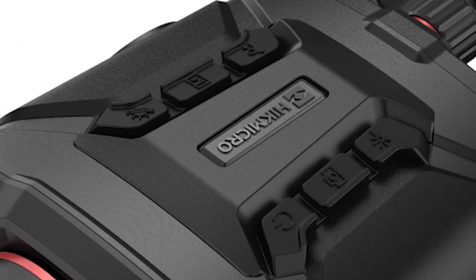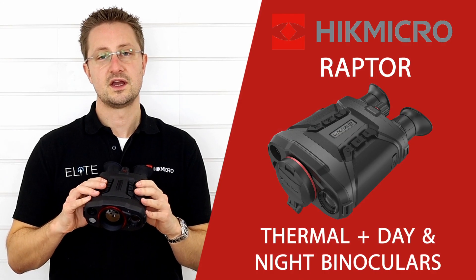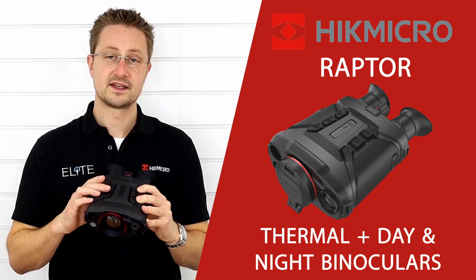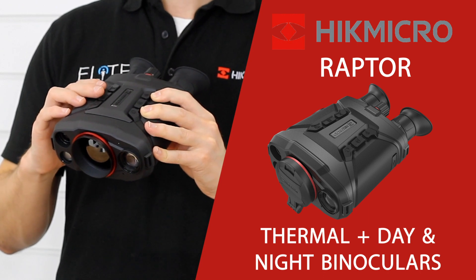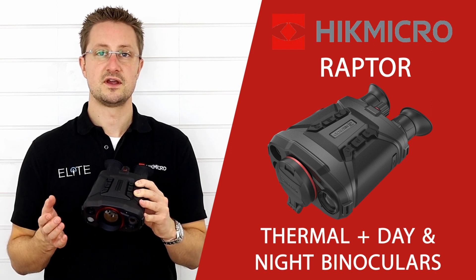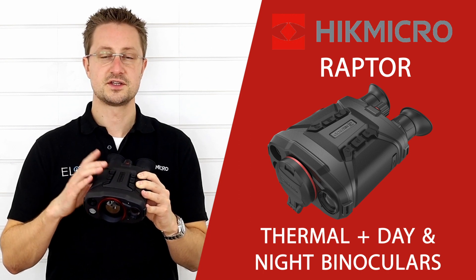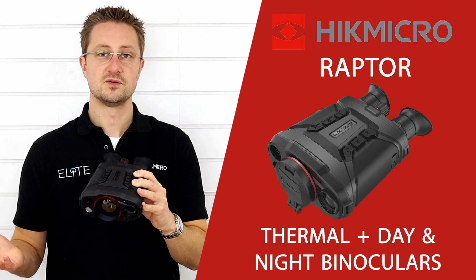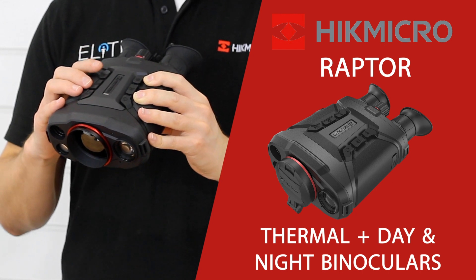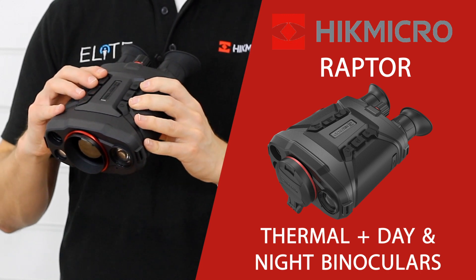On the front there's the mode button for the optical camera, with options for day mode, night mode, or a defog mode designed to cut through the worst weather. There's also the menu button — a short press cycles through the different colour palettes. You can disable any palettes you don't want; for example, set to white hot and optical to quickly shift from thermal to optical mode and back. Finally, the magnification button: a short press jumps up through the magnification ranges, and a long press activates picture-in-picture at the top of the screen.